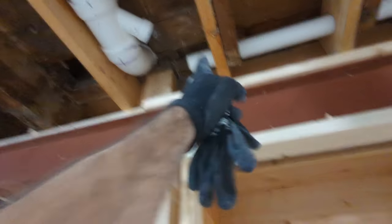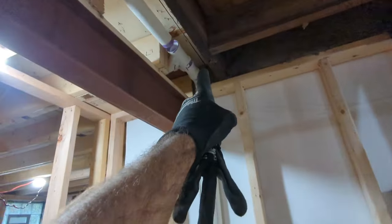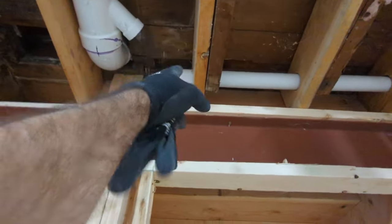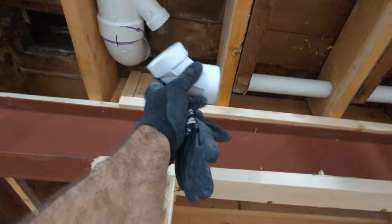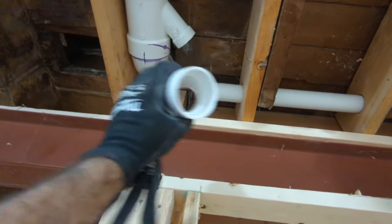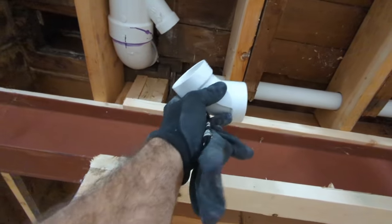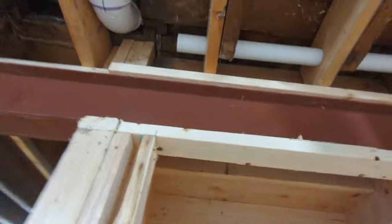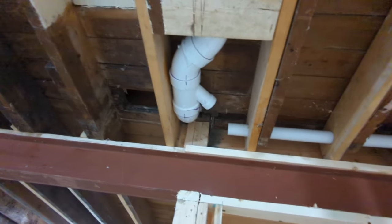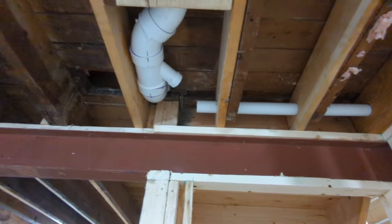Then that'll be a little long because I had to add that fitting to tie the vent in. And then I can do the calculations on how to get a 2-inch leg to a 45 right there, which is what I've got laying right here from what I had mocked up before. And once I work out that it'll fit and dry fit it, then I can juice everything up and sort of roll, smush it into a sense of completion there. I have no alternatives. So we'll see.